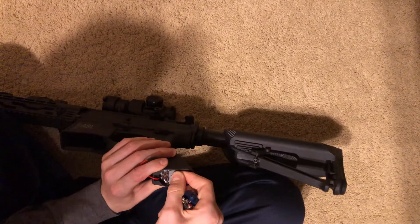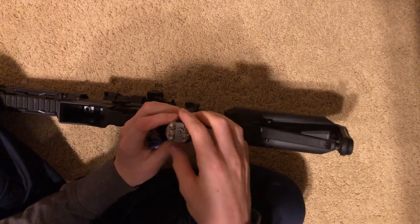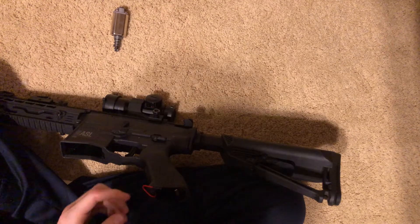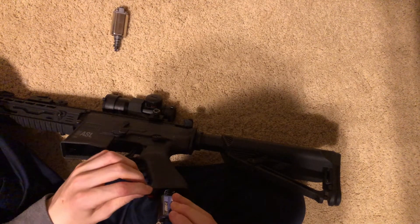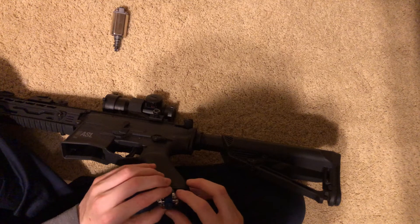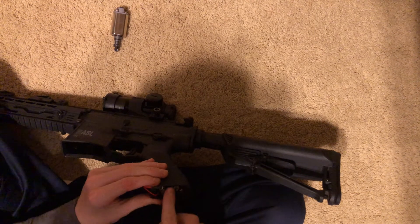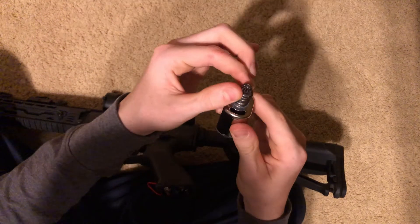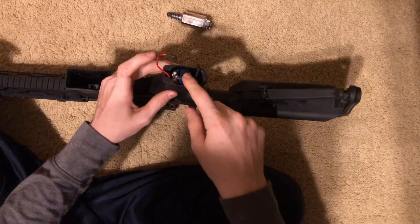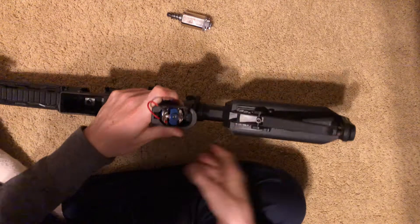Be gentle with these connectors — they are pretty fragile and pretty expensive too. Left goes red, so the red wire goes to the left side. We're just going to slide the motor in and make sure it does go into the hole. There's a little hole and it should go 'boing boing boing' because it's sitting on a spring. Once it's in place, get those wires plugged in. I'll show you a closer view once I'm done.